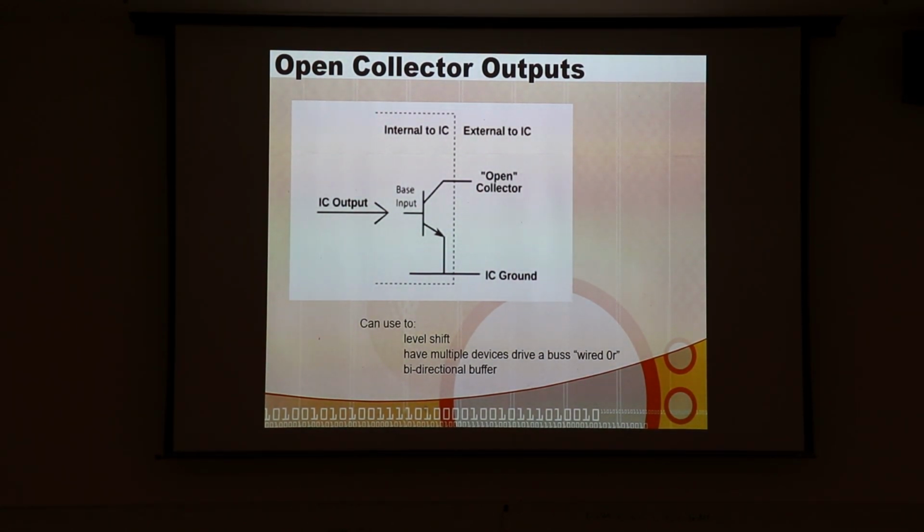Whereas there's no mechanism for that in SPI. On the other hand, SPI runs in megahertz ranges, and I2C runs in kilohertz ranges. So there's pros and cons. But this open collector interface is a really nice way to have bidirectional buses implemented, but they're not as fast as fully driven buses. The only problem with fully driven buses is you must tri-state anything that's supposed to be listening and not sending. Because you can't have two people driving the bus, one high and one low. That's a short circuit. And you'll have really high current flows. So that's how the I2C protocol works. Both lines are driven with open collectors on the master and the slaves.